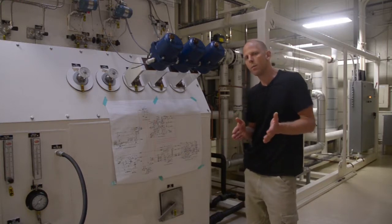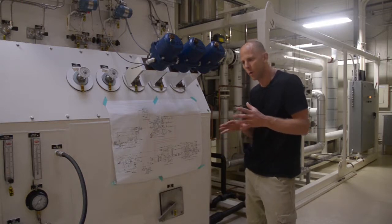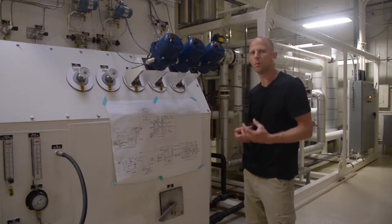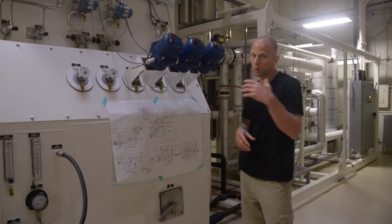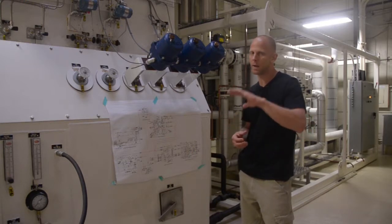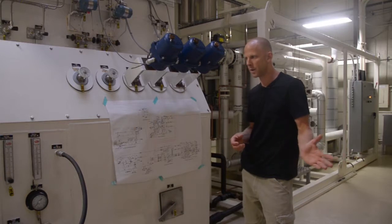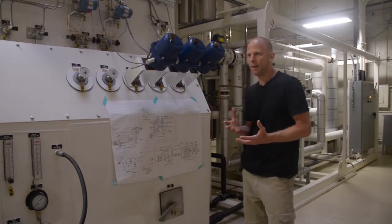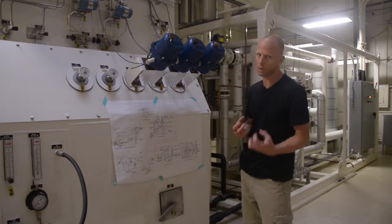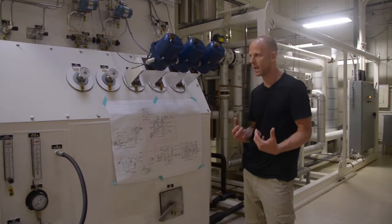The more air that we put to our column, again in very simplistic terms, the more molecules are going to be going into the distillation process. The molecules which flow through the turbine do not enter the distillation process at all. They are merely a cooling stream used to cool, and then they recycle to the compressor. So very simplistically, what we aim to do is produce as much liquid as possible by putting as much to the turbine loop as we possibly can.